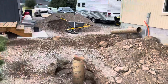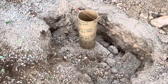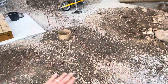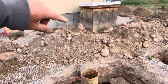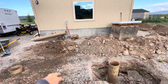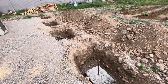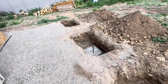We're starting to bury the footers. I ordered a bunch of road base, and for these three — since it'll be gravel around them and no cement slab — I'm putting some road base around the base of it, then backfilling with all the rocky junk-filled dirt, and putting a little road base on top. It'll settle a little over time, but most of that road base will be for the slab side. I'm going to pack it in tightly and compact it as I go up so there won't be any settling issues.